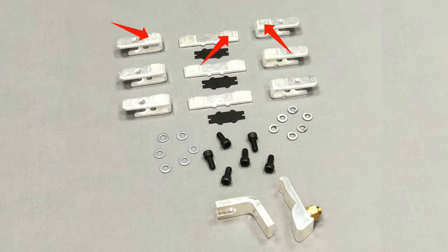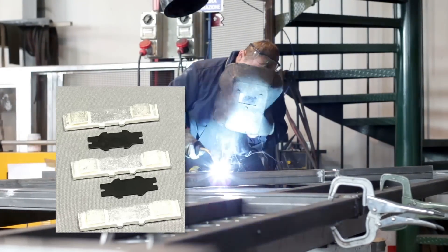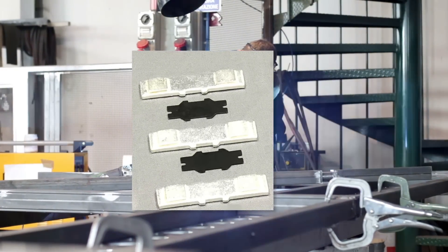These contacts have silver alloy tips that can be square, rectangular, or round. The silver alloy tips are heat brazed onto the CDA 110 copper backing with special silver braze.